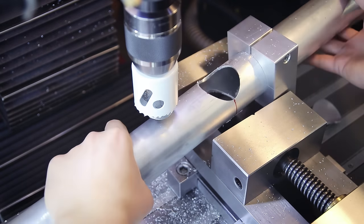Now the two side pieces are tacked up, and there's a reason I place the tack welds at about 45 degrees from the top. This leaves the top surface of that part flat, which means I can flip it over and clamp it flat against the table to tack the other side.